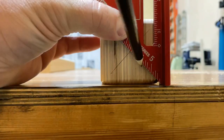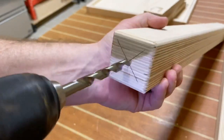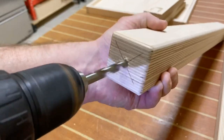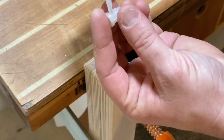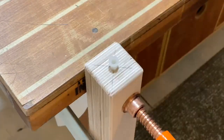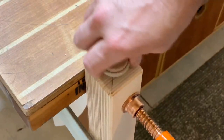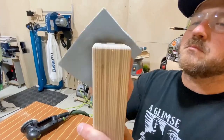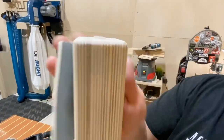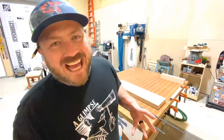We're also going to find the center of the bottom of all the legs by cross-hatching some 45-degree angle measurements. Then I'm going to drill a hole that's going to accept a collar, because I want to put some adjustable feet on this. Garage floors are notorious for not being level, and this gives that extra added insurance — he won't have to shim a leg, he can just simply adjust it with one of these levelers.